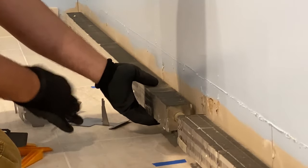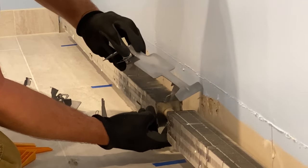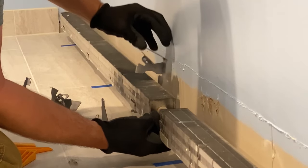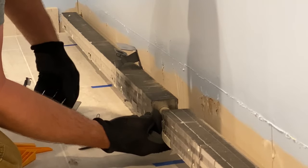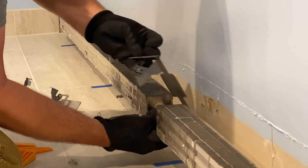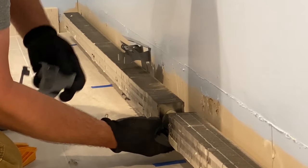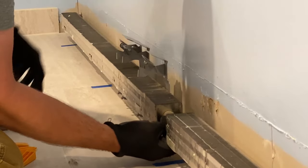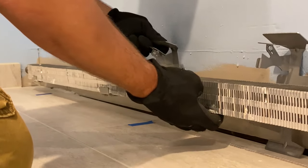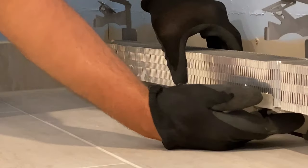What we're going to do first is take our holders and slide them behind the pipe. Remember, you have a little bit of play in most cases so you can pull the pipe out a little bit and just set it there. Make sure you put the holder in the right way — the curved part should be at the top. Once you have all four in, slide them down and they should sit on top of the plastic pieces on the bottom when those are available. Before putting the back panel in, I have to cut a notch out for the pipe so that it'll slide all the way to the floor.